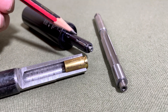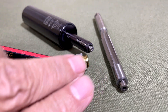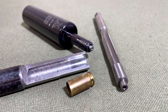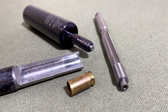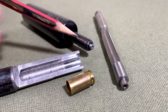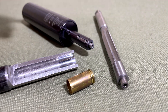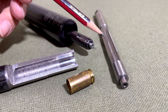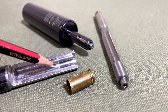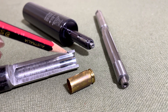What I've done here is cut right through the chamber that we just formed. This is a 9mm case. You can see how the burnishing tool with the rollers has left such a beautiful finish here in the chamber area. The reamer, of course, has finely ground blades, but they leave a dull finish, which you can see there. And where the burnishing tool has been, it's left like a mirror finish in the chamber.